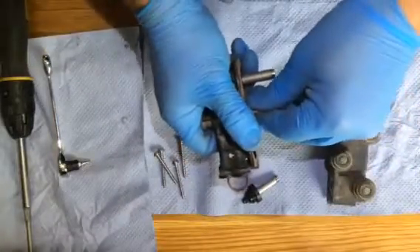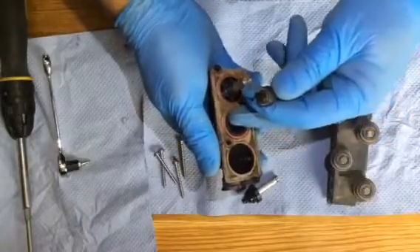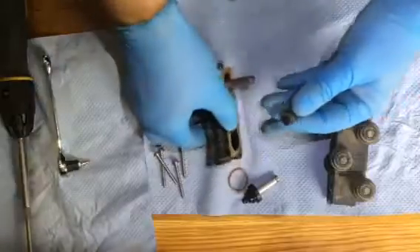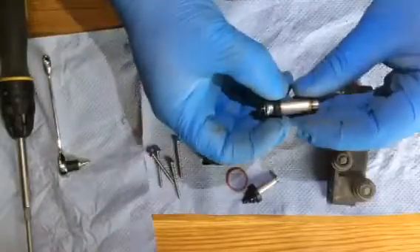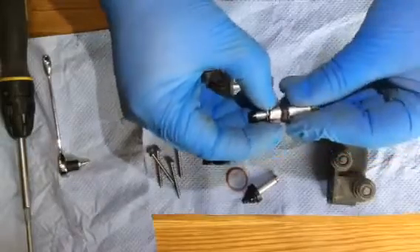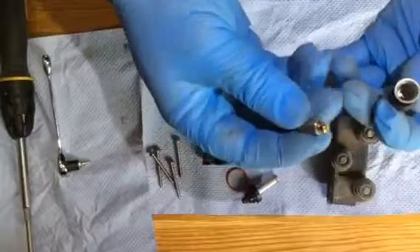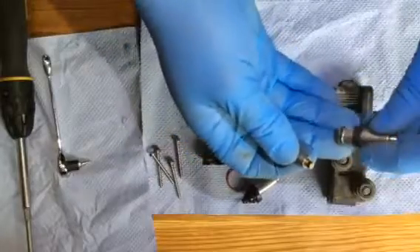This other end one is exactly the same. But the centre one is different. It's remained in there — I could take that out, but I'm not going to bother for this quick rebuild. You've got the same type of start piston, bit of plastic, small rubber seal, and then an internal piston within it. In this one, you've also got a small spring.